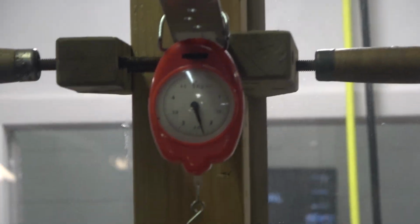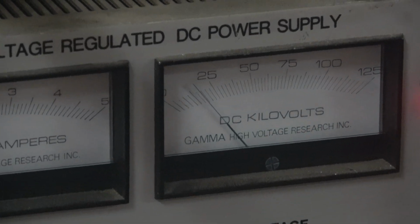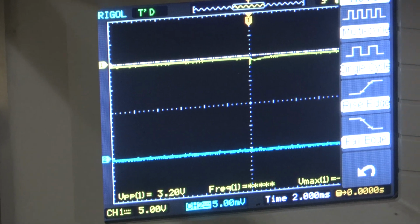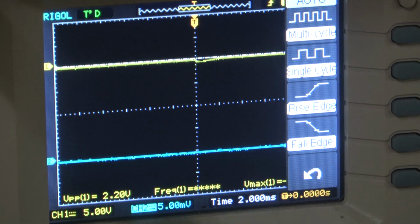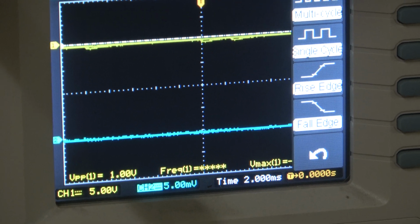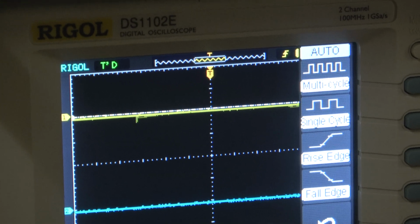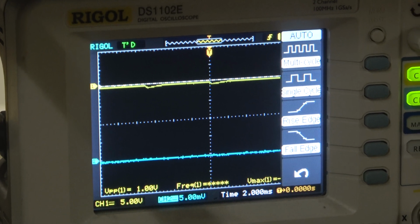Do we need higher voltage on the high voltage DC? Right now the voltage, last I checked, is still really high. Basically 20, which is right where we want it. If we go any higher, we might arc or we might create too much ozone or whatever other ionized gas around there, which makes it arc.